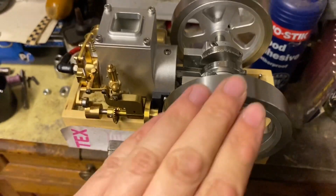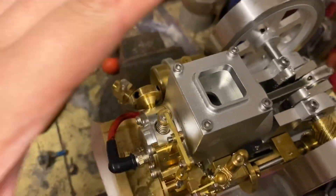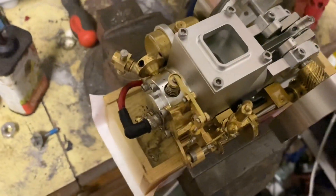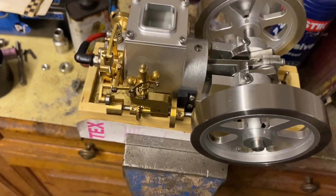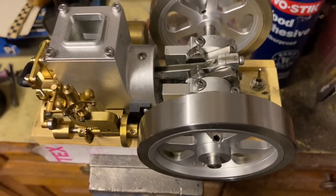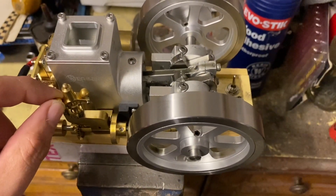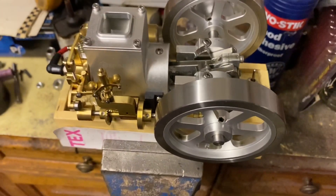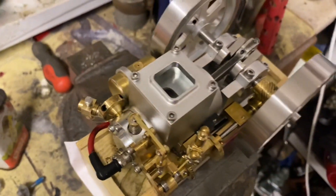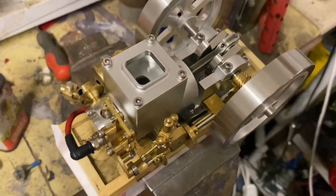Obviously it shouldn't be a problem corrosion-wise, not unless it was going to be left for ages, but it shouldn't be an issue. But you can tell just how small this engine is — she is tiny. And yeah, it seems to run relatively well, though it obviously wants a little bit of attention. This little issue with the water is probably not going to help it — it's probably losing a little bit of compression. I'm told if you fiddle a little bit with the governor, you can get it to run a little bit slower and miss more often. Because at the moment it's almost hitting every time — it's definitely got a bit of a miss to it, but it's not quite as refined as some of the old hit and miss engines would be.